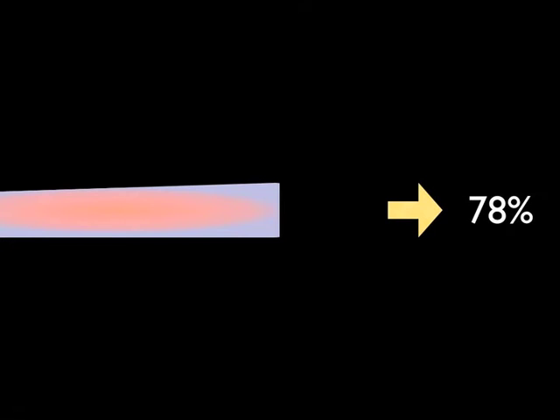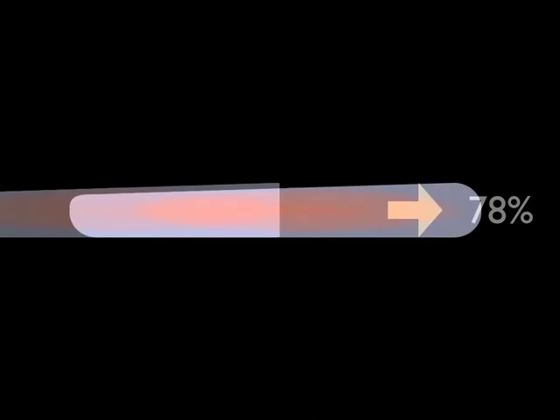But as we can see from this diagram, often the heart metal has not been penetrated. The only way to ensure that you've penetrated the heart metal of the coin is to abrade much more thoroughly, or to cut the coin in half, which would give a much more accurate reading but do intolerable damage to the coin.